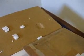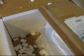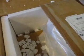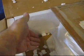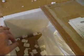And that's because this guy, all of his effort was on the bottom. You have the scope in the box upside down and about a 2-inch air gap on the top. Things just go up and down through transit. You see that too when you have a big, heavy test instrument inside a box with a whole bunch of popcorn. It's kind of like shipping a brick. The brick starts out in the middle of the box and gradually takes a nosedive, crashes in somewhere, and then it gets set down hard one time.